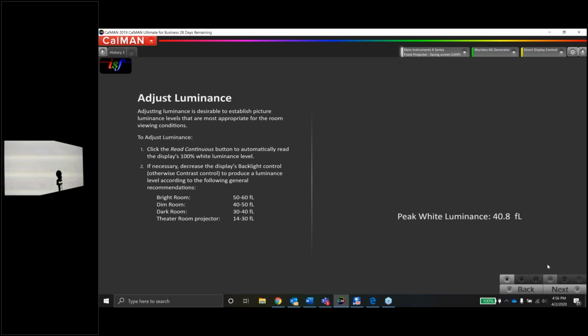So here's the question. You sacrifice that light output to see some more boxes that might not be in the content anyway, or you sacrifice box 235 and up to get a little more light. You know, it's kind of a judgment call to make on site. In a case like this, where my walls are white and stuff, I might go for a little bit brighter picture, you know? So we'll stick with that. We'll stick with standard for now.